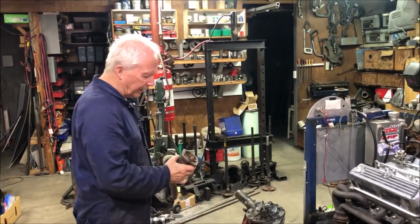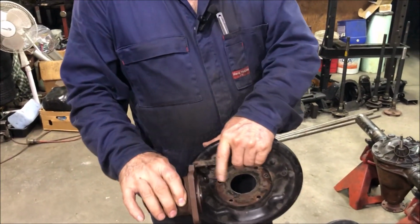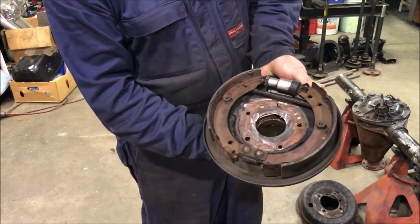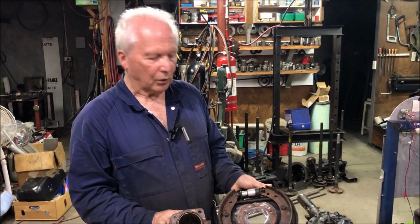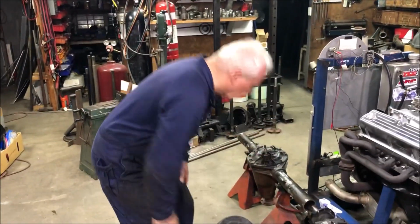That's the end cut off that diff. I've already started cutting the diff, and you can see there's a little lip on there, so I've got to bore that centre out to suit the end of that diff. Once I've got that on there, I can turn it around and get it orientated into the correct position. So, that's those bits and pieces.